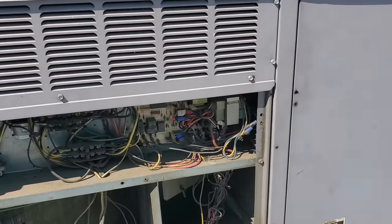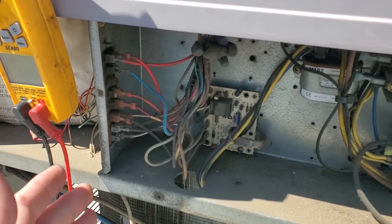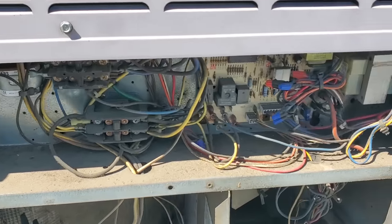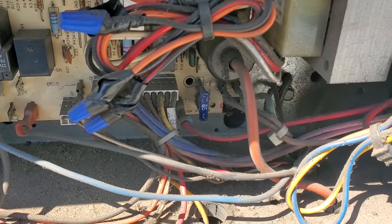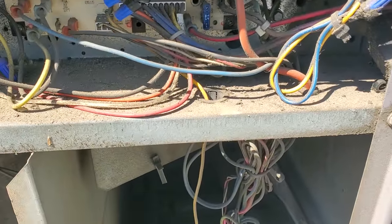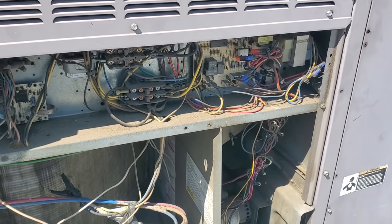I think two of them turned on. The rest aren't, so I'm troubleshooting a few things — going into the thermostat wiring, testing to see if we have a call for heat. We don't. Just observing things. And I come over here and this catches my eye: that's a 15-amp fuse on the control board. Yeah, that's supposed to be a 5-amp fuse. We don't do that kind of crap. Come on, people.